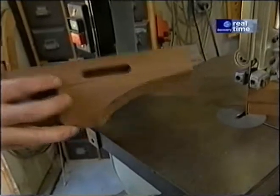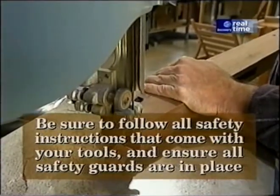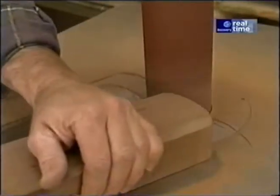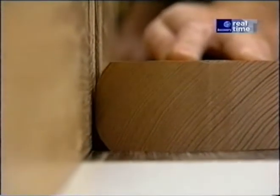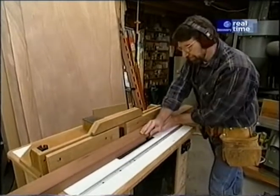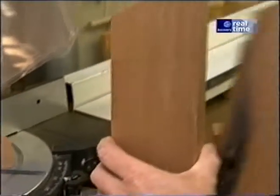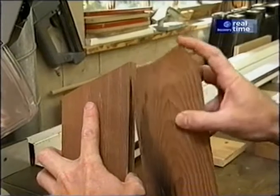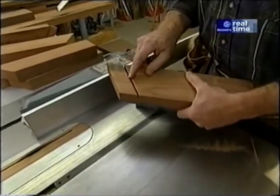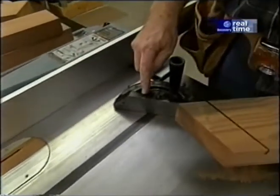Here I'm beginning to shape the handle — no sharp corners, so here I'm rounding the end at the head. To ease the top edges of each rail, I'm using a portion of a one-inch radius router bit in my router table. Here I'm beginning to form the legs. First I make a 30-degree cut where it's going to meet the rail, and then I'm going to form a tenon. Shoulder cuts are next. I've set the saw half an inch above the table, adjusted the fence for a one-and-a-half-inch long tenon, and I'm using my miter gauge set at 30 degrees.